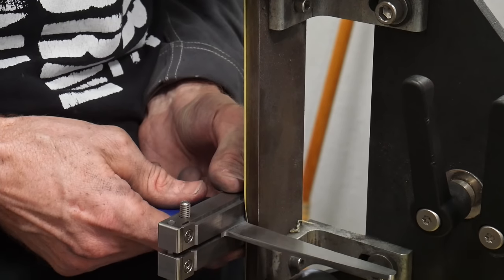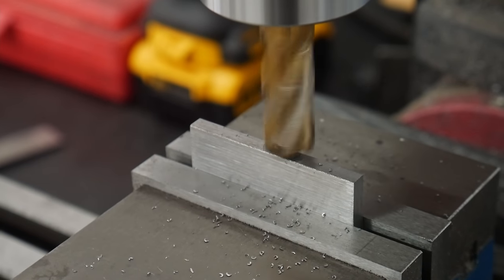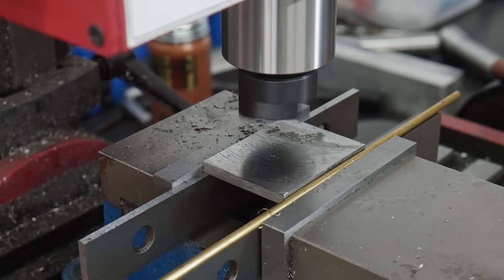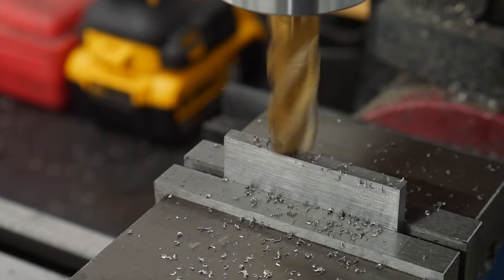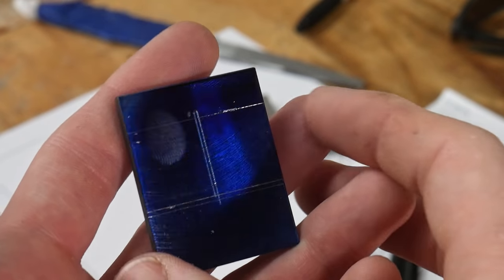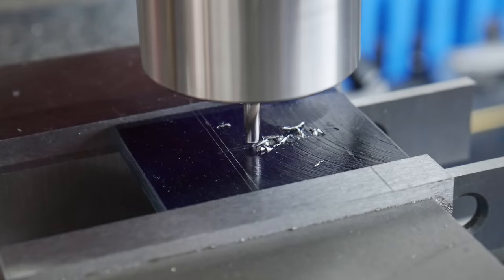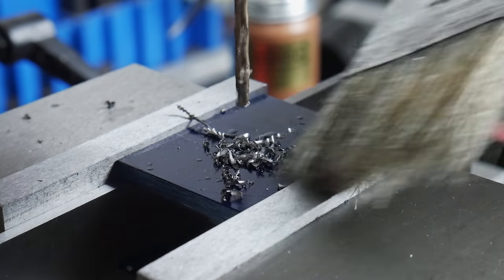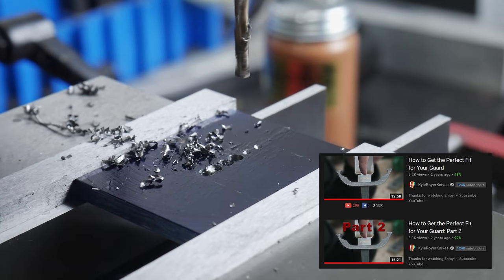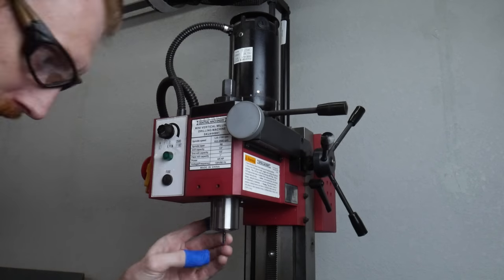I hit the ricasso again in the shoulder area for my tang — I'm still figuring out the right time to true up the tang shoulders. I like doing it after heat treating so there's no oxidation sitting on those shoulders. In the future I may grind the shoulders with the file guide after heat treating. I've seen a lot of guys use the mill to machine in their shoulders before heat treat, but I saw a Kyle Royer video where he machined his shoulders post heat treat using a carbide end mill after draw-tempering the tang so it's not nearly as hard. There are a lot of ways to skin the cat on getting nice square shoulders.